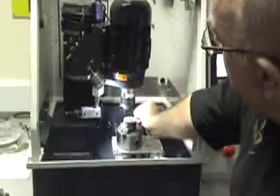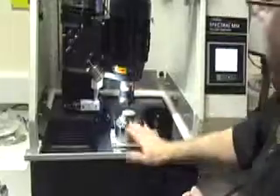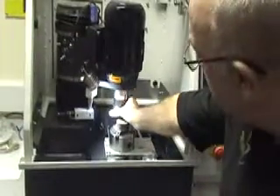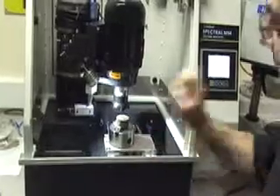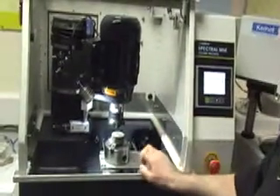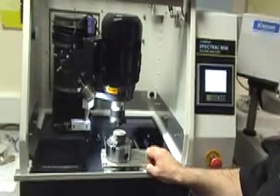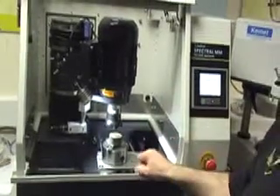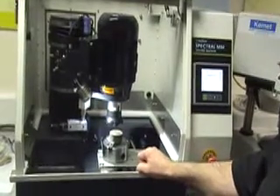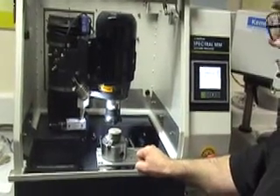With reference to the cutting inserts, it should be noted that the machine is used dry, and with this type of face mill cutter and inserts that is the best way to use it. With tungsten carbide, inserts either need to be used dry or if you do use coolant you need to flood the coolant — it must not be intermittent or you will get thermal cracking of the tungsten carbide inserts.